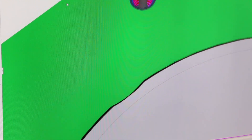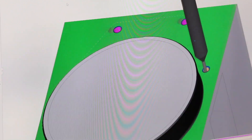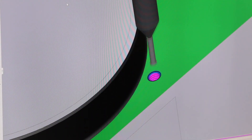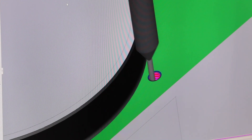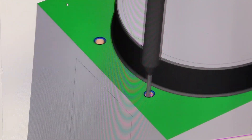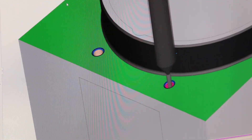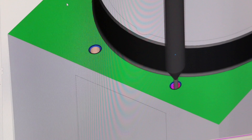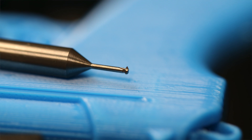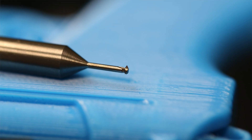It's wild that the simulation shows you exactly how it's going to be. So I'm out there machining this right now and I was a little scared at first because this tool — the diameter of the tip of this thing is 60 thousandths of an inch. It just looks like a little nothing. Insanely tiny, but you've got to do what you've got to do to get those threaded holes.